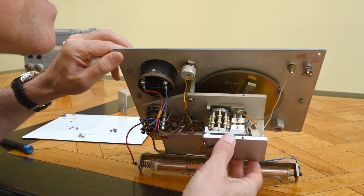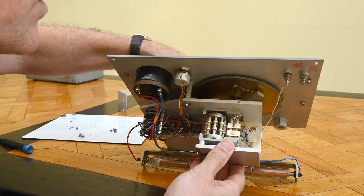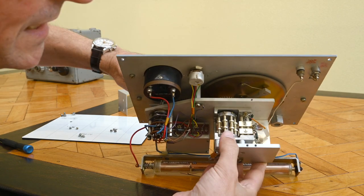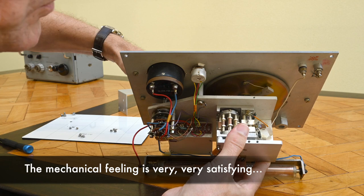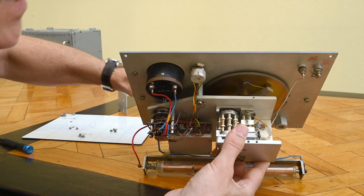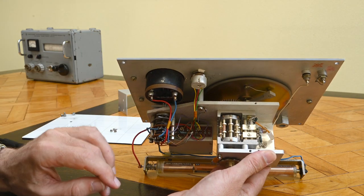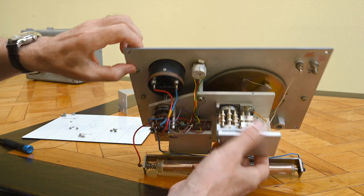What we do see is a beautifully engineered piece of mechanics. Turning the dial basically tunes a capacitor. And look at that — turning the range selector, I can see a range of coils arranged in a kind of revolver mechanism. So by turning the range button you get another coil. These are probably high-precision coils and a high-precision capacitor — otherwise you would not achieve the claimed 0.5% precision across such a wide range.